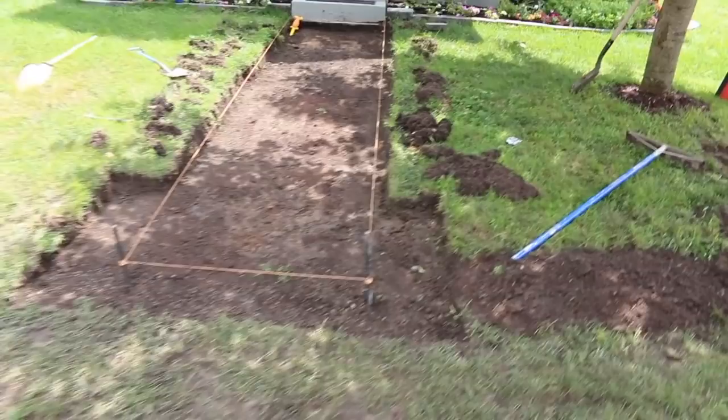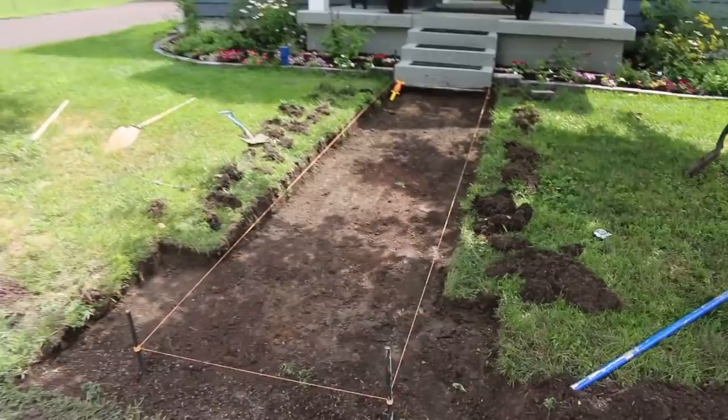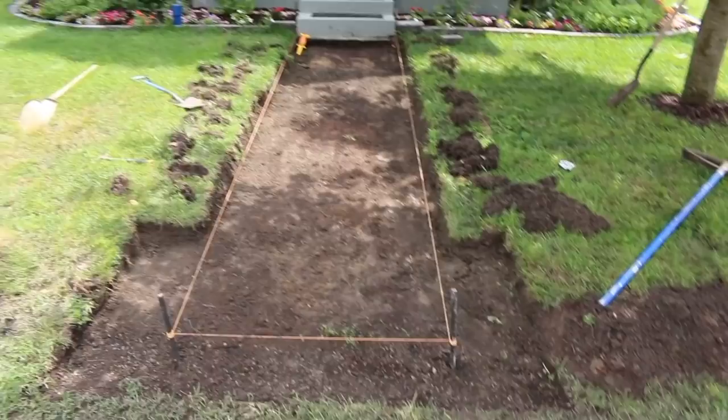And like I said, I'm not using a laser level. I took a 2 foot level right here, took this guy, and then just kind of set it in the trench as I went. You set it in there and then work your way back, set it in every 2 foot or something and work your way back. As long as it's level, that's about it. And then we'll put our rock in.